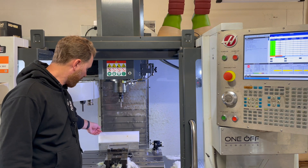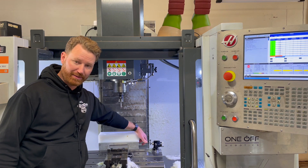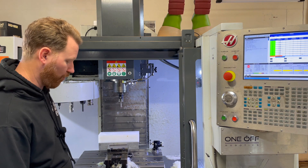We're going to probe right in the center, just like we talked about in the previous videos. We can probe right here, or here, or here, or here — wherever we want to, even on the bottom if we desire. The only thing that matters is it needs to be in the same place you put it in Fusion. That's so important.